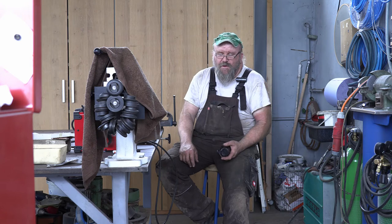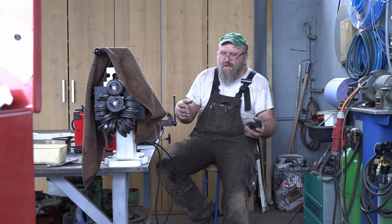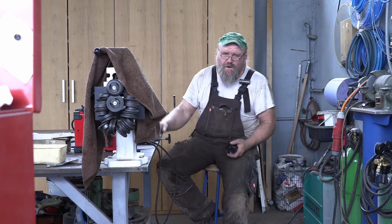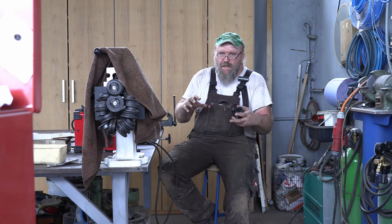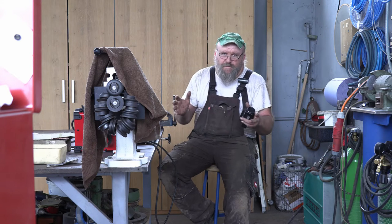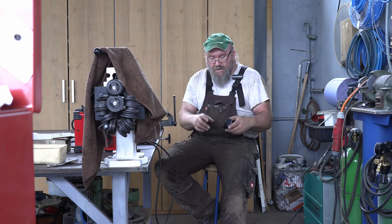They'll get a paint job and out the door they go. The next step is a lot of stuff I'm not going to put on camera because it's just so mundane — wire brushing the housing, the components, the base, the whole nine yards to get everything ready for painting. The destructive part comes now where we're going to cut the volute out and save the front and back plates of the volute because they're serviceable. They're not optimal, but they're serviceable, and we're going to try to shave off a few days off the build.